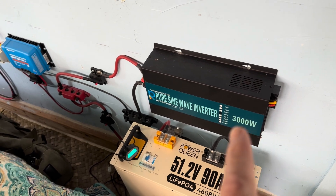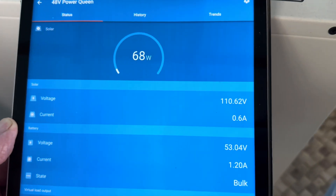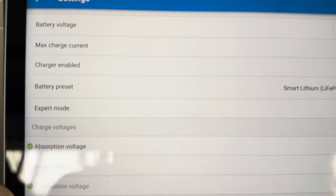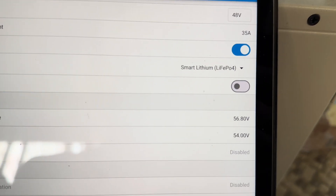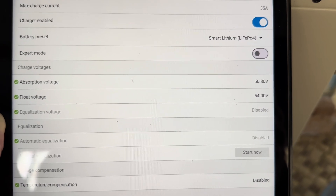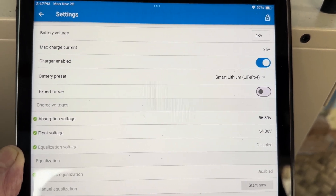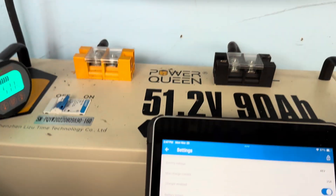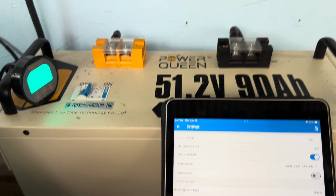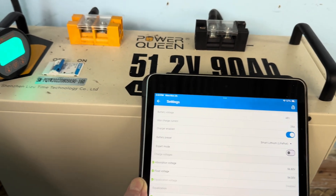I started tweaking my charge controller lower and lower just to have everything keep running. But now I'm going to leave that inverter off. Looking at the app for this system — end of the charging day, got a good charge — but I'm resetting the charging parameters. I went back into the charge controller and set the battery preset to smart lithium iron phosphate. Now I'm going to drive it up to 56.8 volts for absorption, floated at 54. This battery hasn't been charged up to 56.8 in a very long time, and I believe once I do that, I will have balanced all the cells.